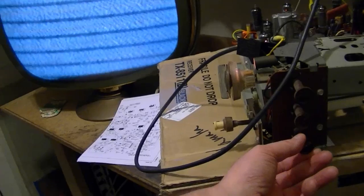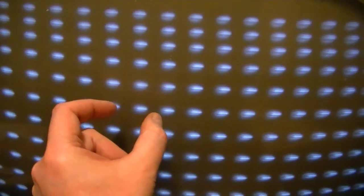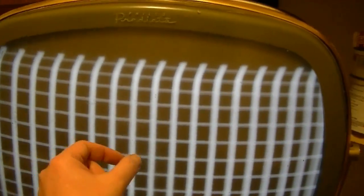Same with the horizontal — no sync, rotate the control, bam, locks in. It is a test pattern. I don't know about the levels I'm using, and this isn't exactly the cleanest setup, but it's something. There is a problem with this — when I was doing my Sentinel-430, I noticed that the crosshatch should be really sharp vertical and horizontal lines, and these should be dots. But they're turning out to be wide dashes. At first I thought it was the TV, but it's definitely this device. So the crosshatch and dot patterns have become messed up — the horizontal is spread out. But the other patterns are still okay — the multi-burst sweep still has sharp lines.